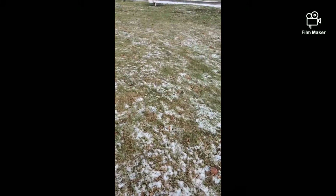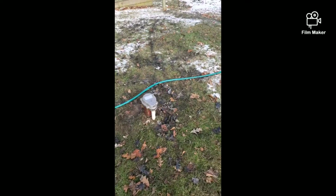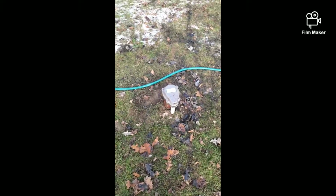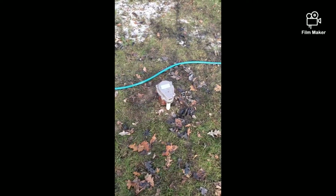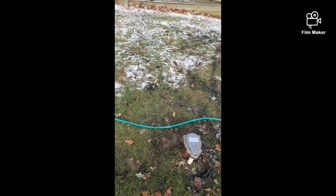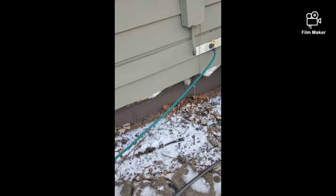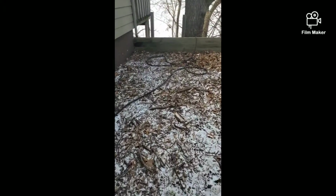Stand by. Alright guys, so it turned out to be really a broken neutral in this case. The wire nut was on too tight, broke the wire. So, took it off, stripped new wire, made sure everything was good, popped the power back on. Like you saw, I already disinfected it. So this is gonna run all day. This is actually the responsible party's hose. I'm gonna take my frozen one. And then later on this afternoon, the responsible party's already been instructed to turn it off and put all the softeners and filters back in service. But other than that, that completes this job.